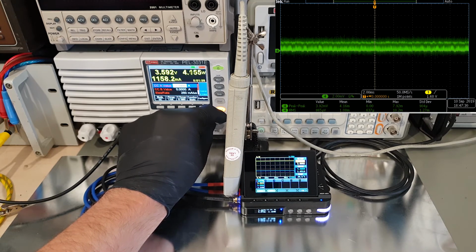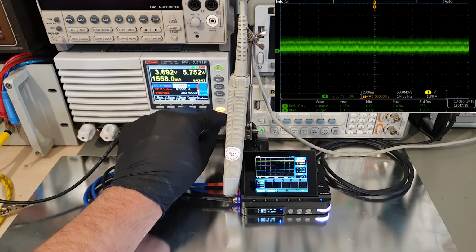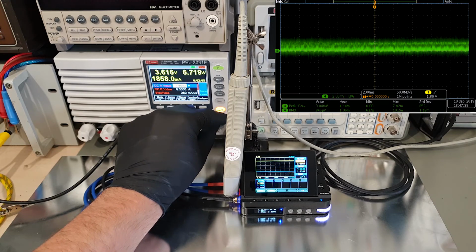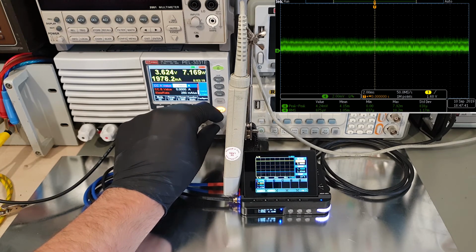Here I'm regulating down from 5 to 3.3 volt while pulling a lot of current. Noise is even better, but the voltage is too high. Strange. Could this be an attempt at compensating voltage drop over the test leads? If so, I would advise against it. It's a natural effect that everybody expects. If it's overcompensating on the other hand, it's just confusing.